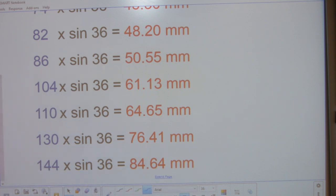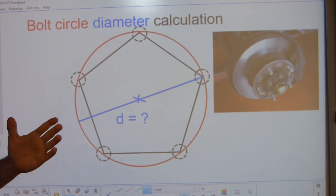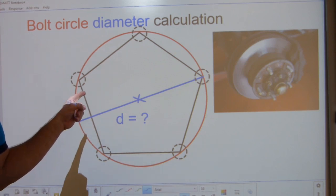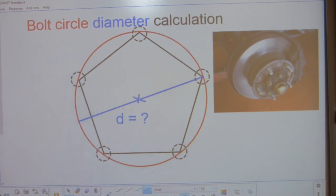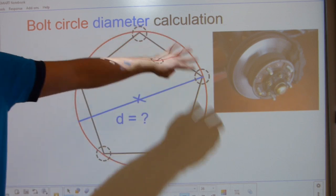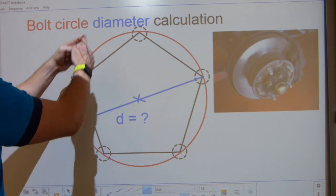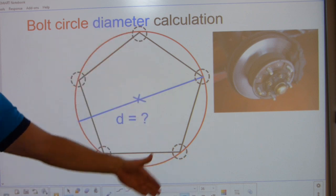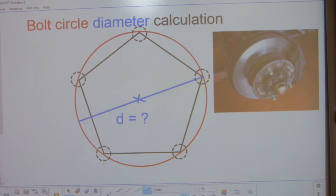That's basically what I wanted to show you. The measurement and the bolt circle diameter can be combined like this, and that bolt circle diameter is needed for getting the correct parts that fit your machine, or to start your layout work by drawing this circle first, then laying out as many holes as you need along its circumference for mounting flanges together. Thank you very much for watching!